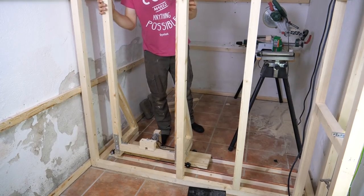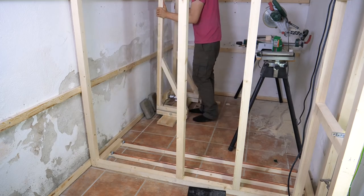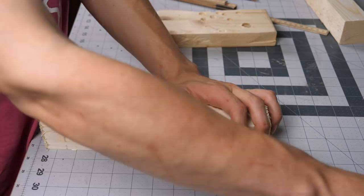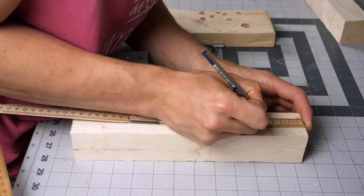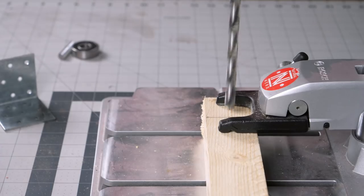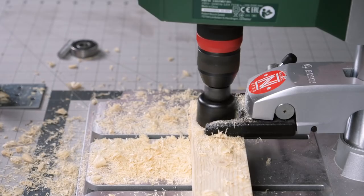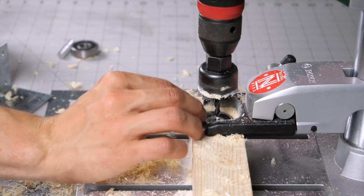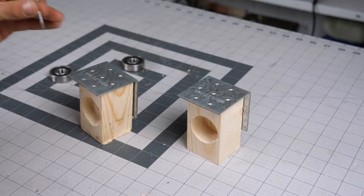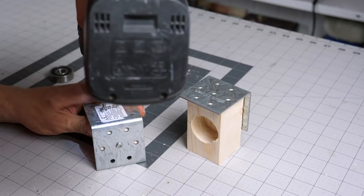The left to right movement of the door will be driven by a threaded rod, which will also be attached to the rails. To support it and to lift it up to match the height of the cart, I am building two sockets out of some short pieces of 2x2. To let the rods rotate I am making space for some large ball bearings — I got these in a nearby car parts store, but I will include links to all parts in the description. In case the threaded rod manages to push its way through the wood, I am adding some metal plates to the back.